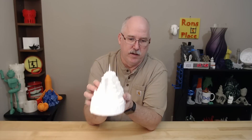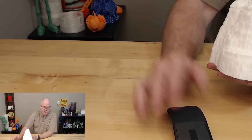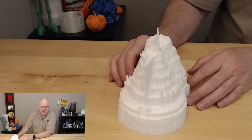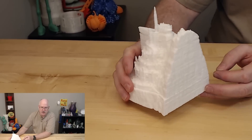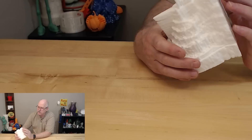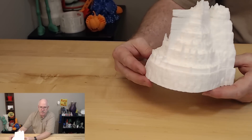So this is the print. It's totally washed out — white just doesn't show up well. From a distance it doesn't look bad, but you can kind of start seeing what's going on. I had to babysit this print the whole way. You can see more of it here — it's all layers, it's under-extruded, inconsistent extrusion. It's just a mess, but the print concept itself looked okay.